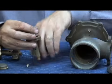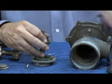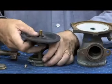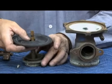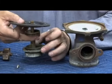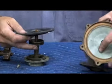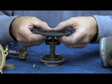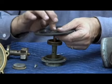This was the stem that they started with, and it looked like this. Relief valve disc was on the bottom, the seat was here, diaphragm was on top. In other words, the way this works in the real working assembly was that the stem went down to open, it went up to close. So what was happening in a closed position like this, unfortunately, when you go to test it, the relief valve wouldn't open because the disc wouldn't come off of the seat. So again, back to the earliest generation was this one. And what was concerned was that this diaphragm was pushing down, even with that sharp-shaped spring knob on the top pushing down the stem.